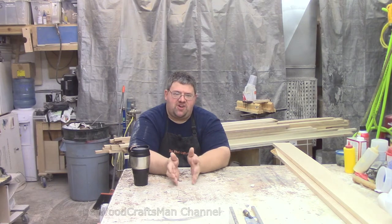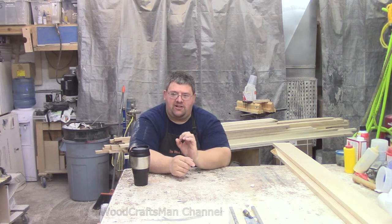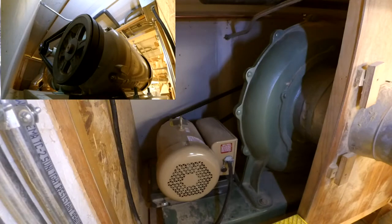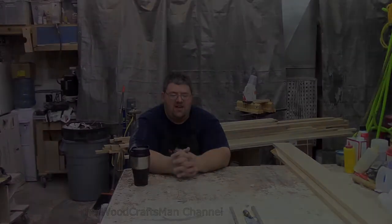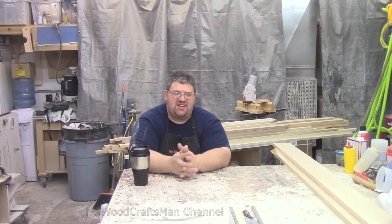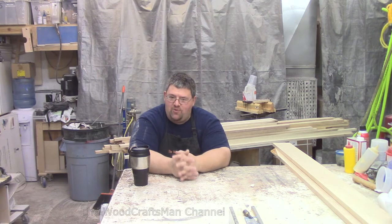Now, even though I'm using a soft start to start this motor like I used to on my 5-horse motor, it would still trip the 30 amp breaker periodically on startup, even with that soft start. When I talked to my electrician, he basically said ideally I just need to do the 8 gauge wire and a 40 amp breaker and be done with it. So that's kind of what I ended up doing next.